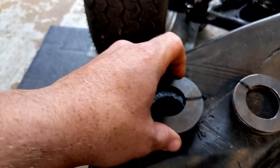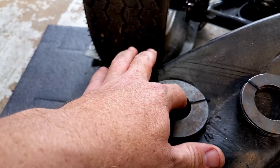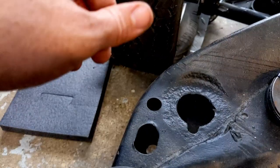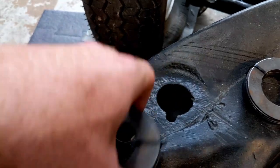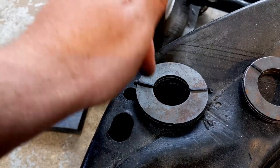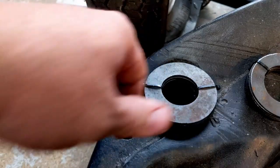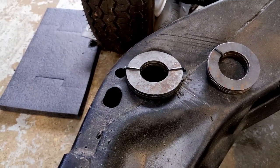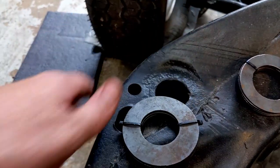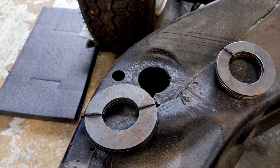The plan is to line the new washer piece on the center hole here. Then I'm going to use a scribe to scribe the frame to the outside, then use a hole saw lined up on that scribe line and go straight down. From there I should be able to just drop this straight in, use some magnets to hold it in place, throw some tack welds on it, and then weld up around the perimeter. Then just like the other stuff, grind it down and make it smooth because we don't want any interference. It's pretty tight here, so when that box is sitting on here we want to make sure it's not going to hit anything — then paint it and call it a day. We're going to get started with that and see how things go.